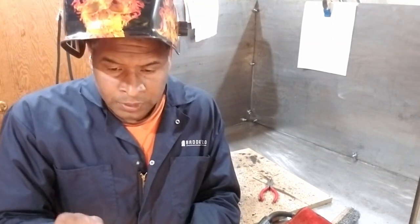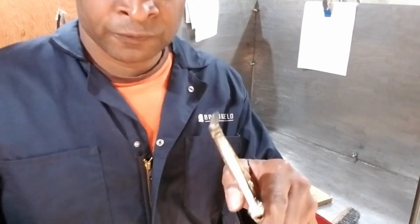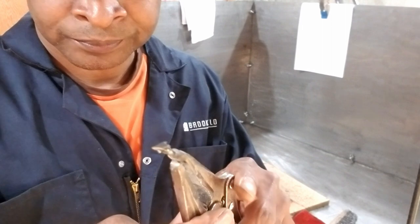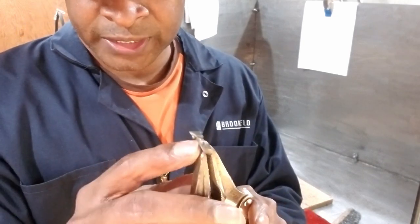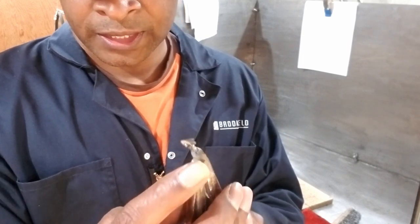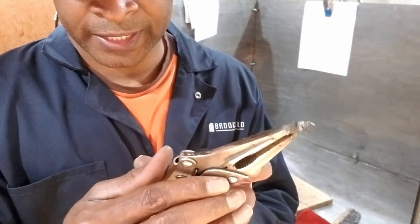This is going to be the starting point for my scroll. I want to have some sort of motion to it. With the scroll, I have two pieces of those blanks welded — a bigger piece and then a smaller piece. This is going to be the head. This part here which I'm holding with the pliers is the body, and the scroll is going to be looking at an angle. You can see that head there — it's at an angle to the bottom.